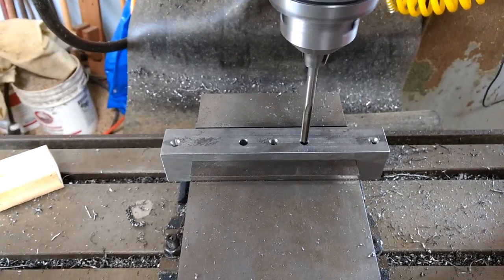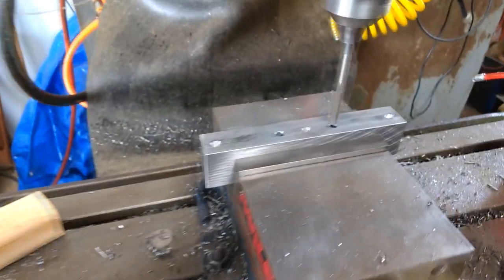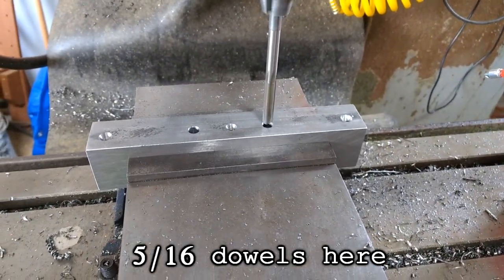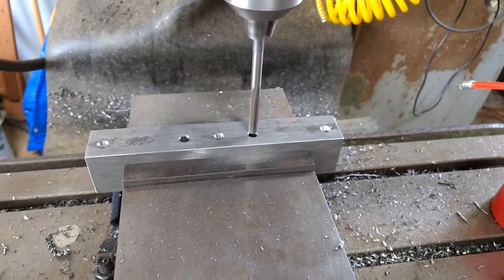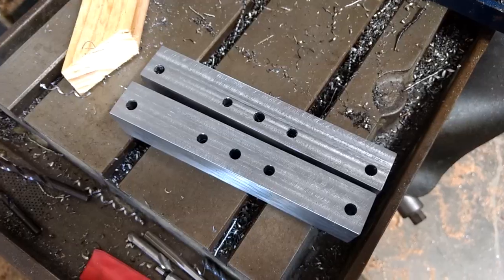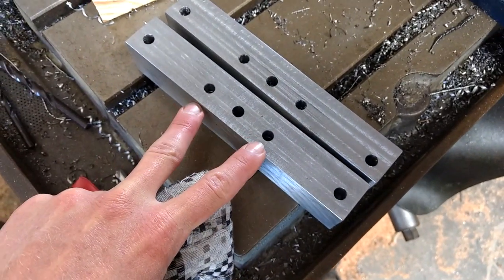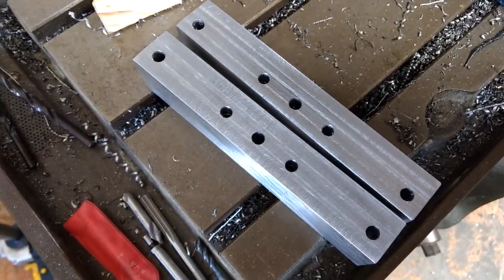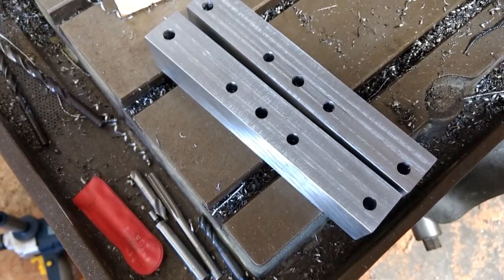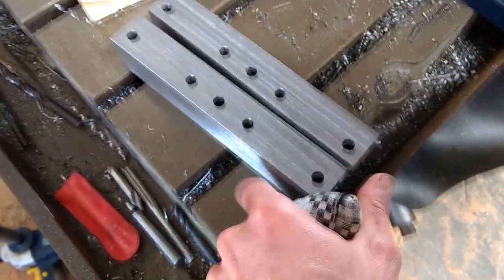A little drilling and reaming action here — I'm using the drill hog bits I won at the Bar-Z Bash two years ago, and reaming the holes for a dowel to make sure the position doesn't change when I bolt it to the side of the soap dish mold. Got both rails drilled and reamed. The reamed holes go all the way through, but the reamer only went about a half-inch deep because I'm using one-inch dowels — don't want to get them stuck, so there's a knockout hole from the other side.